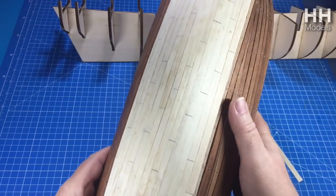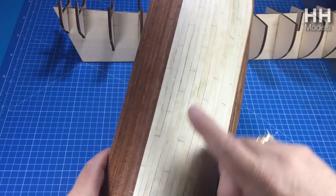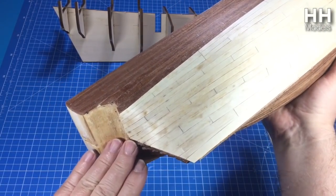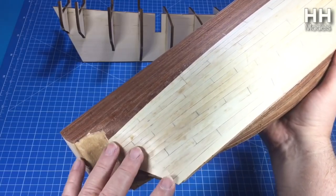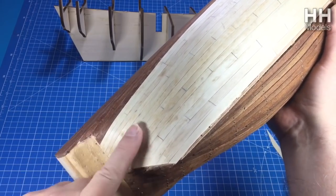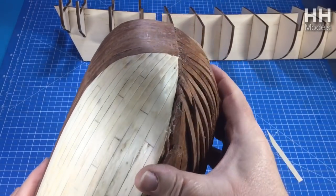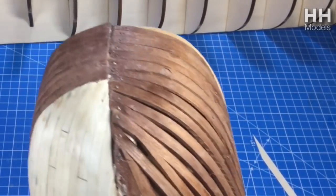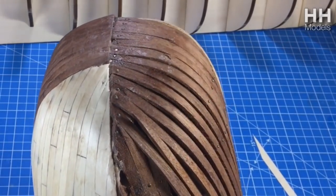What you're aiming for all the time is that your planks will be basically parallel to the keel. So there's a curve, and you're parallel pretty well all the way through midships. But at the stern it's going to curve up and over. You can see how I've made those very thin planks all curved in and over, and used wedges down here where it was splayed out. The direction changes — it's vertical, then curves up, then curves back. These are quite complex curves, but it's okay. At the bow, I've tapered them, but not a lot, because I wanted that particular look where they all come up.